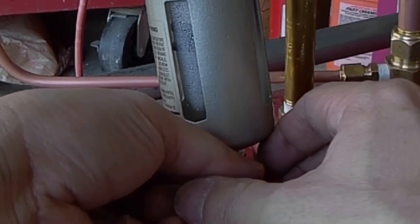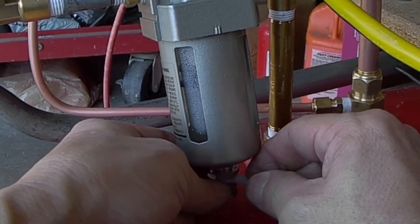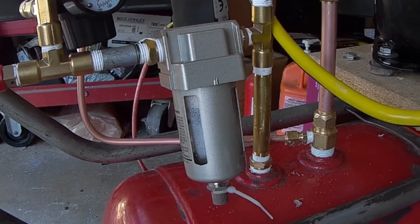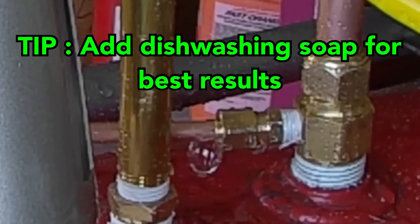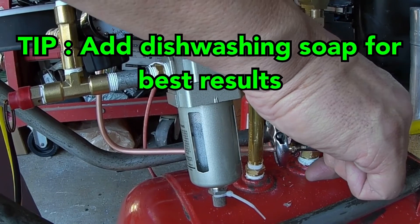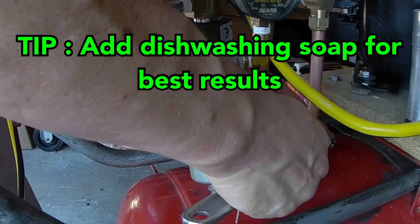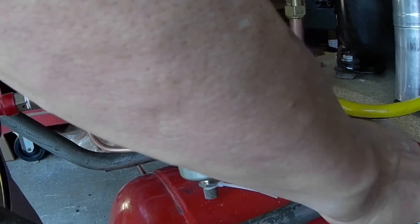In my silent compressor video, I explain why I'm using a zip tie to keep this drain plug closed. After testing, it turns out I still do not have the capacity to pressurize this chamber. What I'm doing here is using a spray bottle to check all my joints and connections to make sure I don't have a leak. As you can see, there was just a tiny bubble there — a small leak. I went over all the fittings, re-tightened them, and checked them until everything was leak-free.